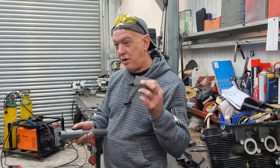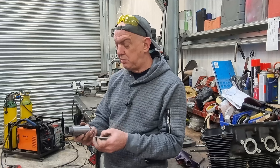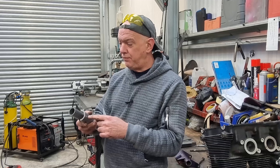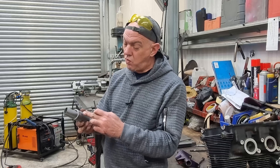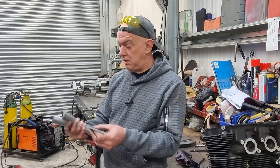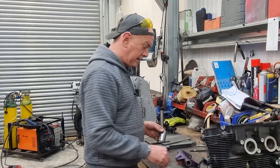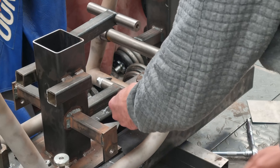They're going to have about 30mm of engagement of thread, so it should be all right. I'm tempted to split that in two and just secure it with one bolt through the frame, because the shape of this is going to snug it all down anyway. And it's going to be braced on this side, so I reckon one bolt through there into one of those bosses should do the trick. So first things first, I'll need to find out the length of this and chop it in two. The kettle's on, so you might hear some grumbling in the background.